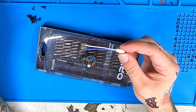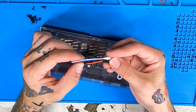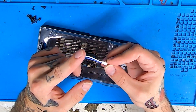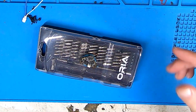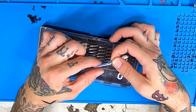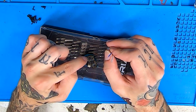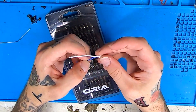This is a very long pigtail — normally I would just use this and it was more than enough. But since I do switch batteries quite a bit, sometimes I leave the pigtail a little longer just in case I get a battery that doesn't have a long pigtail or doesn't have one at all. There are two ways you can put this pigtail on. You don't really need to do it on the top side. You can actually do it on the bottom side and it can go through the frame through the carbon — just put the flight controller in first, then flip it over and there'll be access points on the diamond to solder it from the other side.